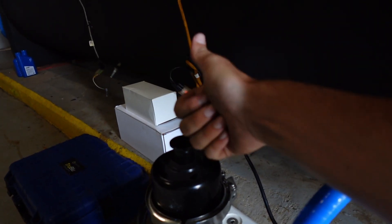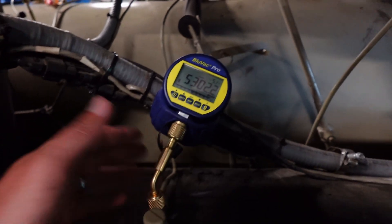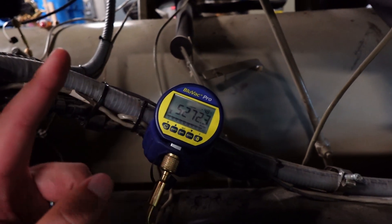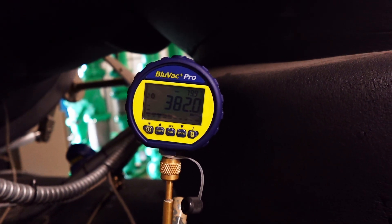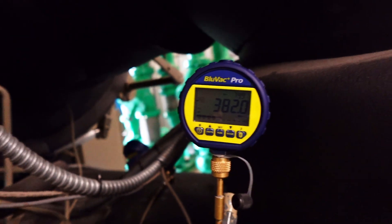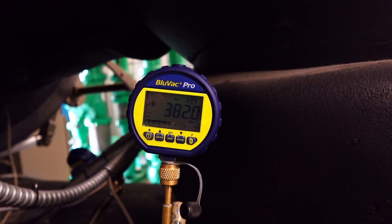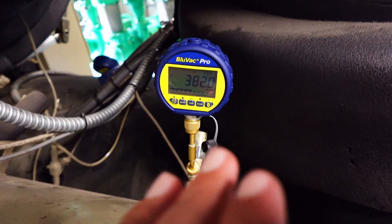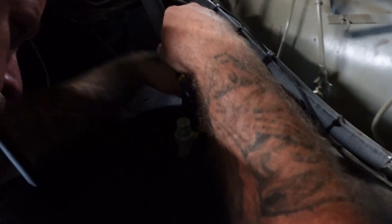With the second pull overnight, we came back and had only pulled down to 5,000 microns, which didn't make any sense. Something told us that couldn't be right, so the technician I was working with had his own Blue Vac gauge and we went over to the condenser valve we'd been putting nitrogen into — sure enough we had 380 microns there. Seeing that something wasn't right, we looked into that return line valve on top of the evap and figured out it was plugged up and not reading proper evaporator pressure.